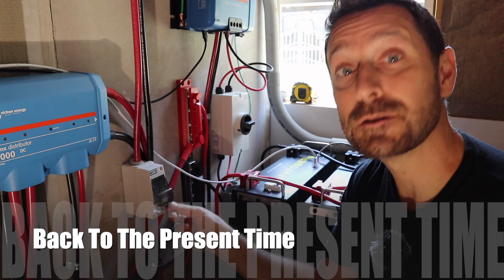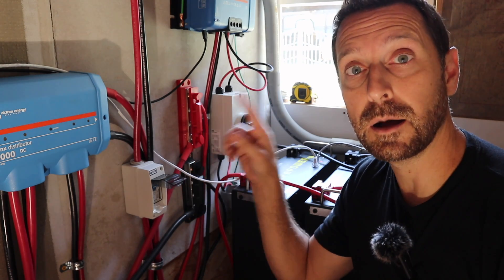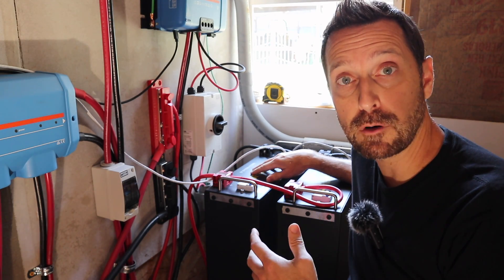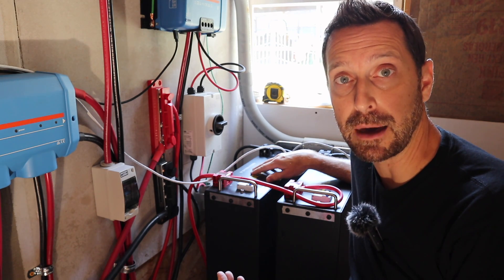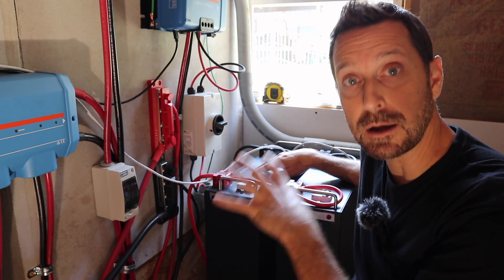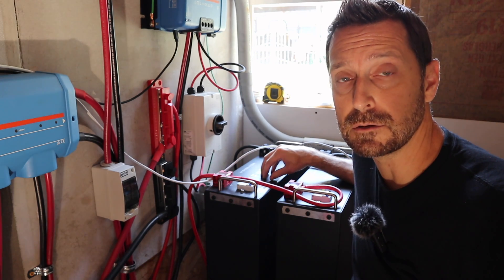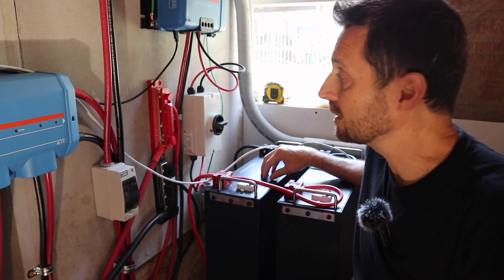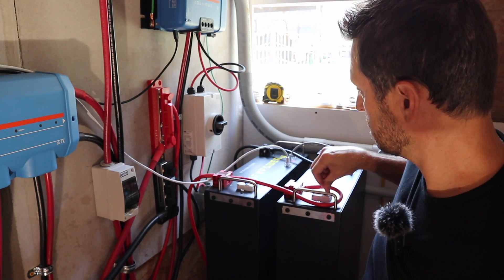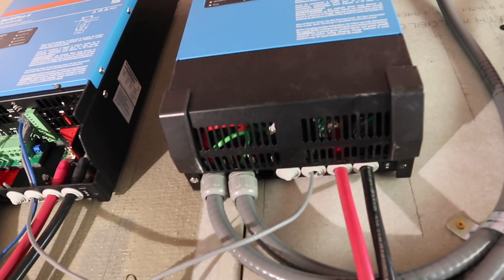That's everything connected — now let's fire it up. First thing we're going to do is turn on our breakers that run on our positive conductor up to our inverters. Next we're going to turn on the batteries. Since we have the EG4 LifePower 4 batteries — and similarly with the EG4 LL batteries — they have an internal pre-charge resistor that will keep that initial rush of energy regulated so that we don't damage our inverters. If you have different types of batteries you need to use a pre-charge resistor when connecting your positive to your positive bus bar. Let's go ahead and turn these on. We have activity on our MPPT. Now let's turn on these inverters.